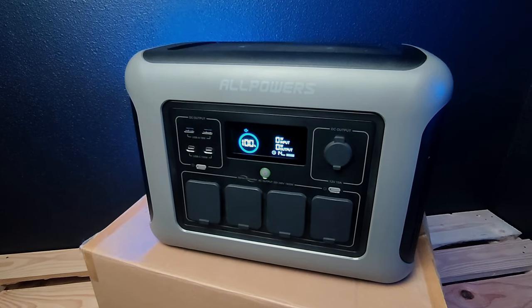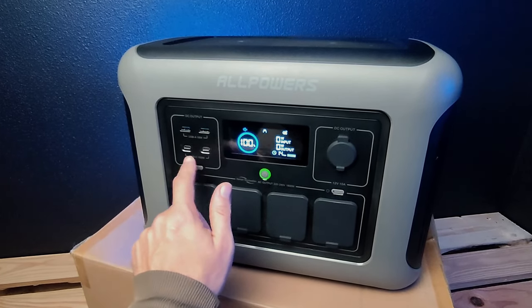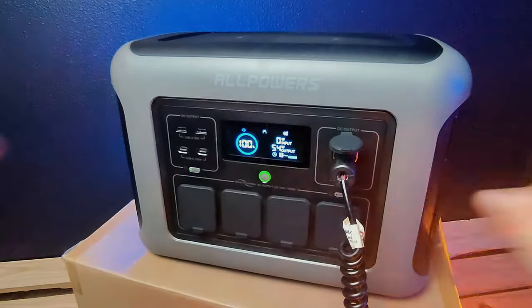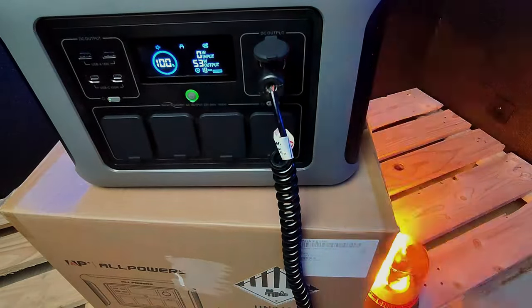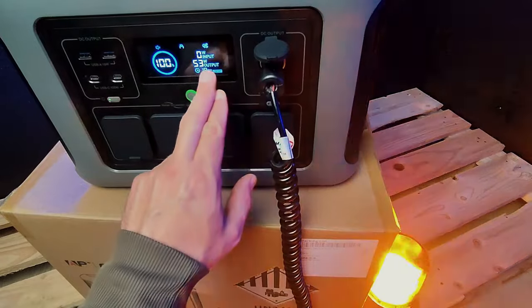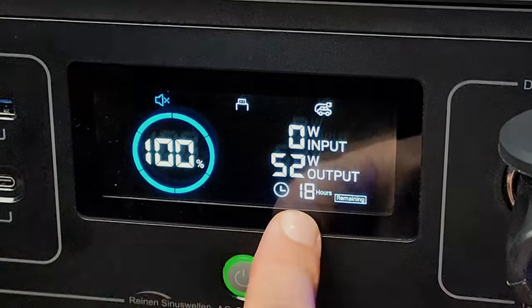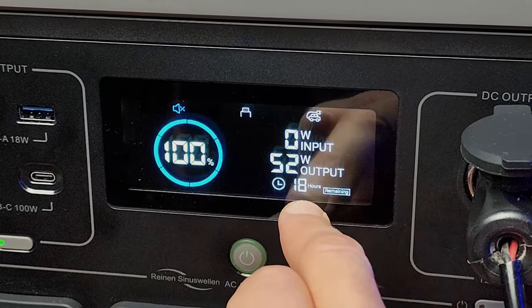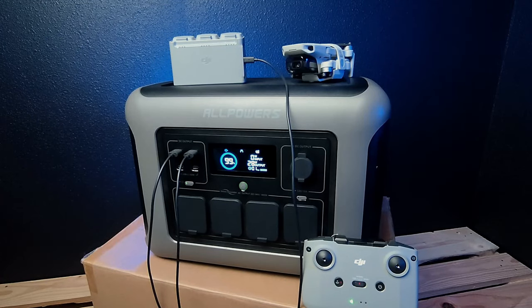The weight of this battery is 16.7 kg. Now let's talk about the cigarette lighter function — we plug in the gyroscope light, activate the cigarette lighter on this button, open the little flap and insert the cigarette lighter plug. We are on a 12-volt cigarette lighter, and we can see a consumption of 53 watts on the gyroscope light, which gives us 18 hours of autonomy to power it.